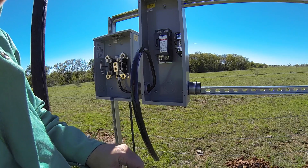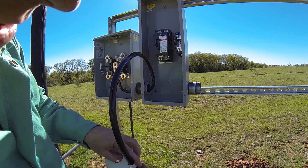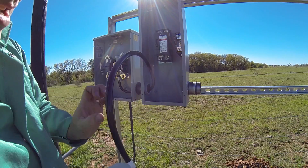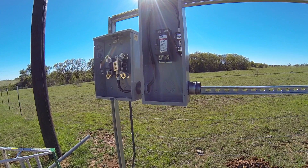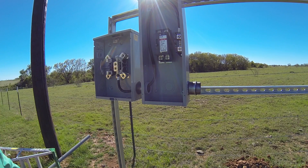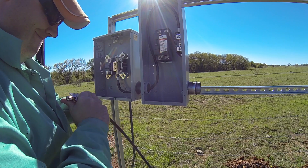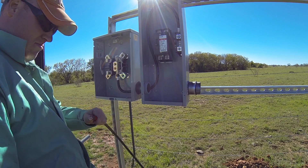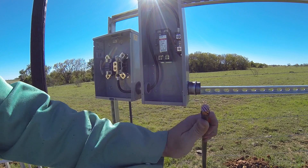Normally you do all three of these at the same time, but I don't have that much extra wire and I don't have very far to go, so I'm doing them one at a time. Just like that, now we're going to do the same thing for the two hots. You always hook up the neutral first.